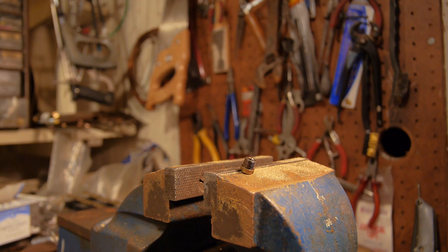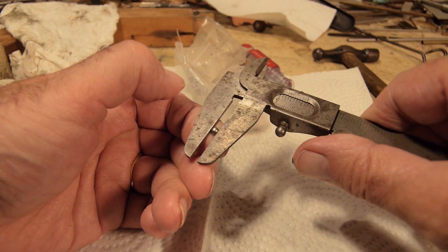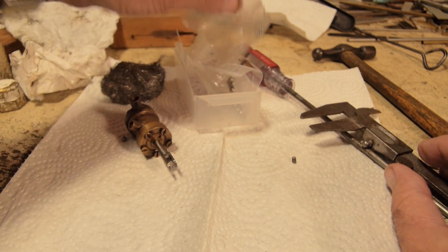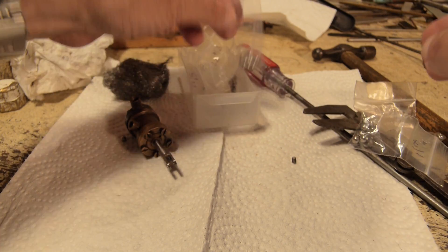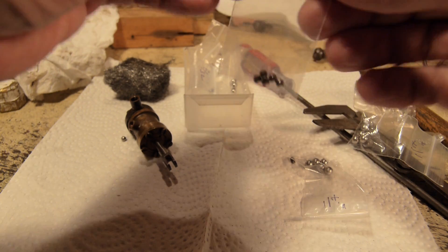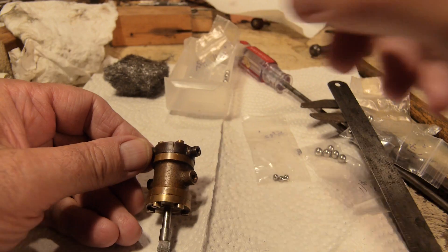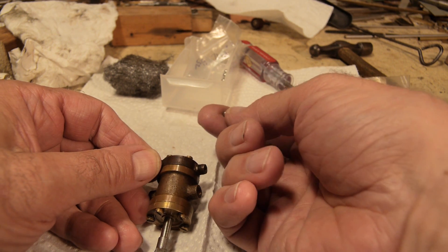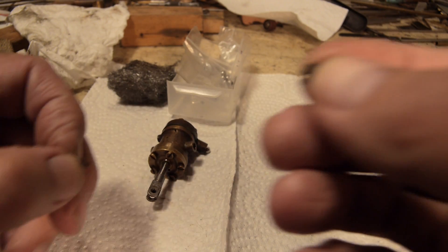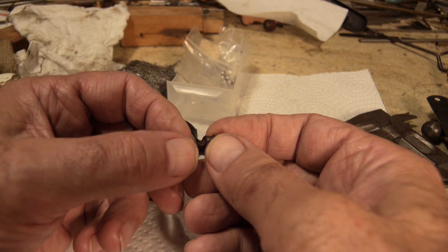Now that seat should be better, but the ball has to be thrown away because it's got a dent in it — I need to get another ball. I make that 5/32nds on the calipers here. Quarter inch? No — 5/32nds. One thing you must always do is throw away the ball that you've just punched into the valve seating, otherwise you'll use it again. I've also just made sure the spring is not binding at all in the hole — it needs to be very, very light.